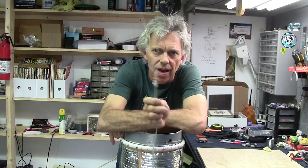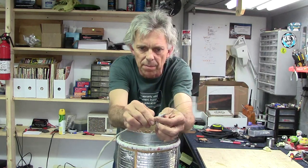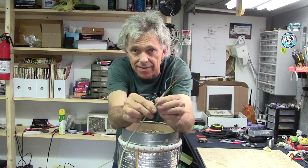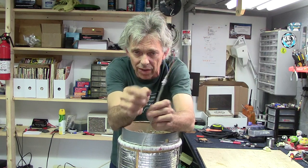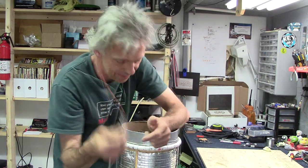I've got a piece of Cat5 cable here. I'm going to use five of the wires in here — the other ones I wrapped up and saved. Good lesson I learned a long time ago: when you have a lot of wire on a loom, just wrap up anything left over and stick it here if you're doing prototyping. You'll have it for later.